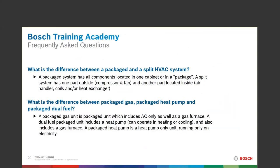A question we get: what's the difference between a package unit and a split system? The split system has the capability of refrigerant lines separating the indoor and outdoor sections — on the IDS1 that was 100 feet, on the IDS2 it's 150 feet. Now all of that is in a box. We are not a gas pack — the gas pack uses fossil fuel like propane or natural gas through a heat exchanger for heat. We are a heat pump, and a heat pump is a maintainer of heat, which is why we probably don't like programmable thermostats.